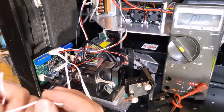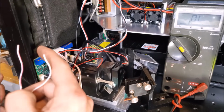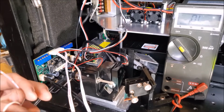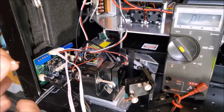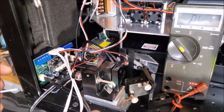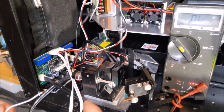Okay, so let's think about this. I'm looking at it backwards, so that means that X deflection is going to be that way because it goes that way. So I need to have the galvo flip this way for the positive orientation. So here's what I'm going to do to figure that out. If I'm looking at the image on the wall, in this case, it'd be like looking towards the video projector. The image will be reversed because I'm looking towards it instead of towards the projection. So I need the galvo to rotate counterclockwise.